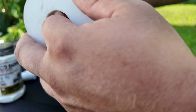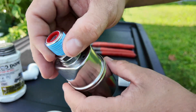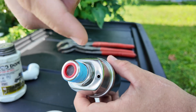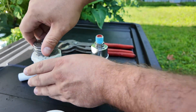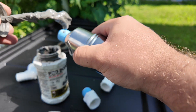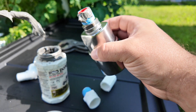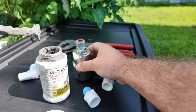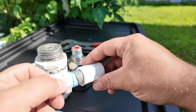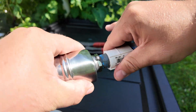If it's your first time working with plumbing, something to know is that you always want your tape wrapped clockwise, so that when you tighten something down it tightens the tape rather than loosening it. I use both pipe dope and Teflon tape — this is thread sealer, or pipe dope depending on who you ask. It's extremely messy, we're painting that on there way too thick, but in reality these threads might be okay because they are not going to be under pressure — only from the water that is in the reservoir.